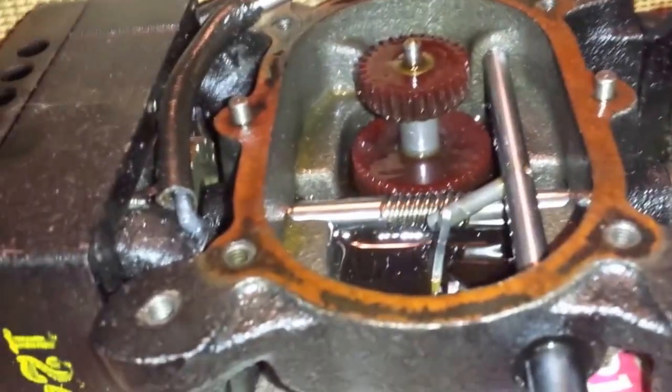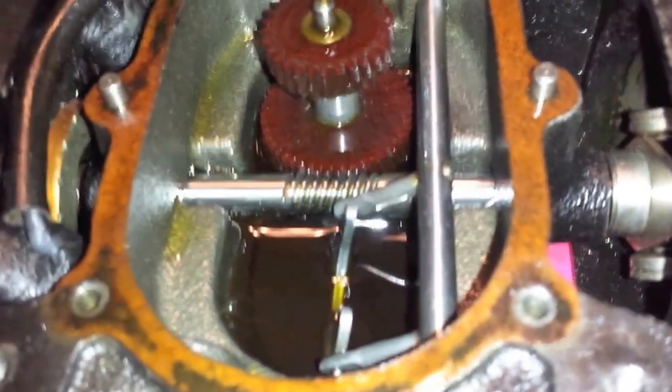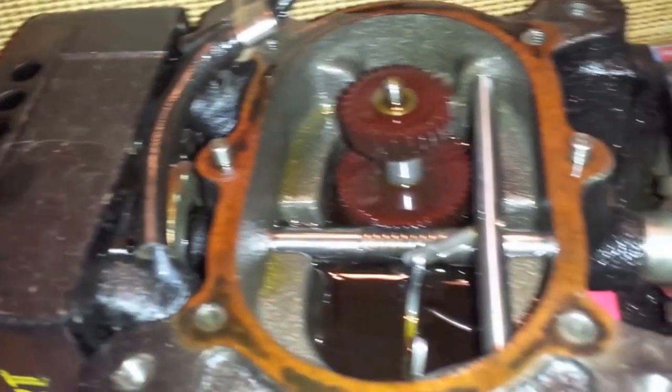Essentially it's a transmission gear drive mechanism. It does leak a little bit — the main shaft seals are bad and I'll need to replace those. I wanted to give a bit more information: this is a Newcomb transcription player from the 1940s. It uses big octal-style tubes, and the drive itself was made by General Industries Company out of Elyria, Ohio — it's called the Flyer electric motor. These machines and companies are no longer around, so finding replacement hardware for a mechanically broken one is very difficult.